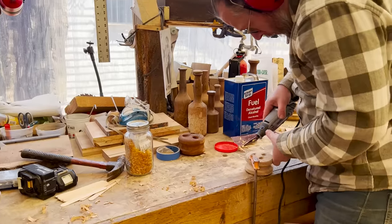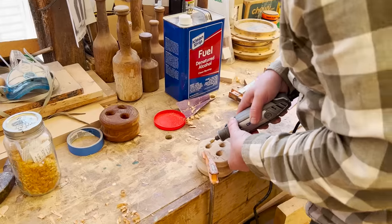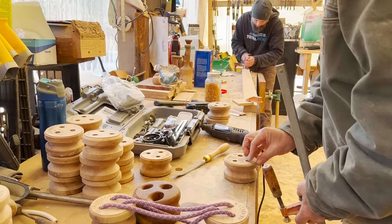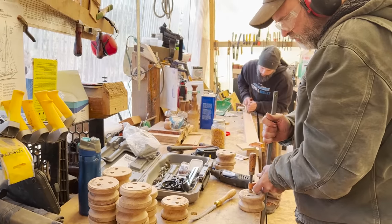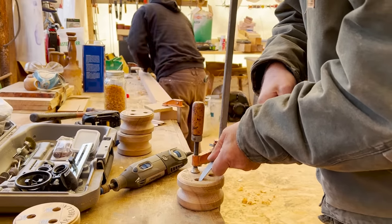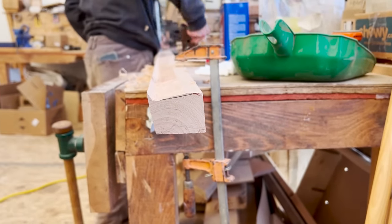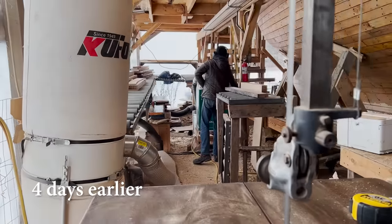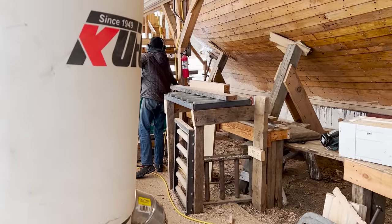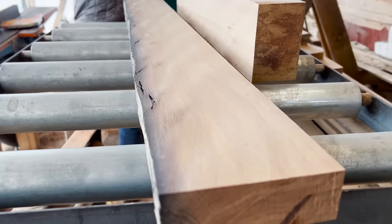While KP took a look at the navigation lighting, volunteers upstairs worked through the deadeyes, which will soon be used to tighten up Arabella's rigging. And on the other side of the bench, Steve was shaping the companionway rails out of cherry. These will end up with a locust cap with plastic runners that the hatch will slide on. Steve had started assembling all the materials a few days before. He planned to use what remained of the live oak stock for the sill and the drop board rails.